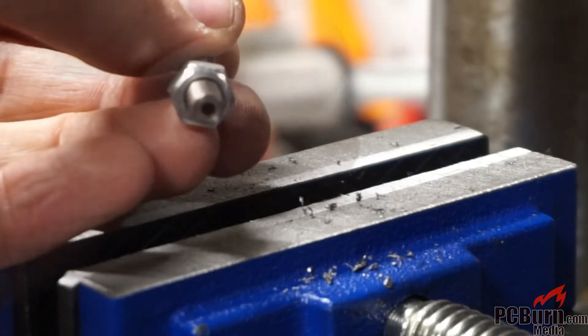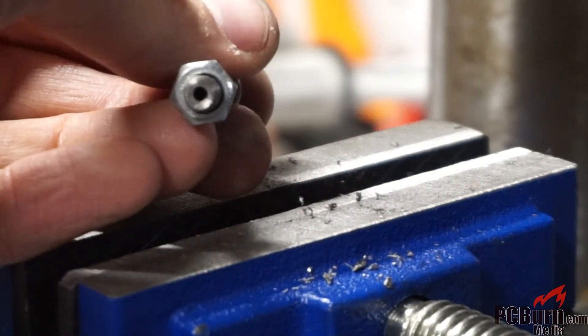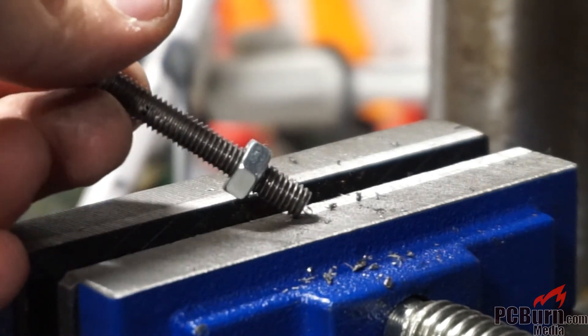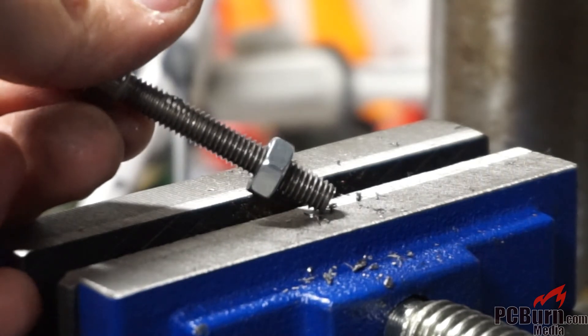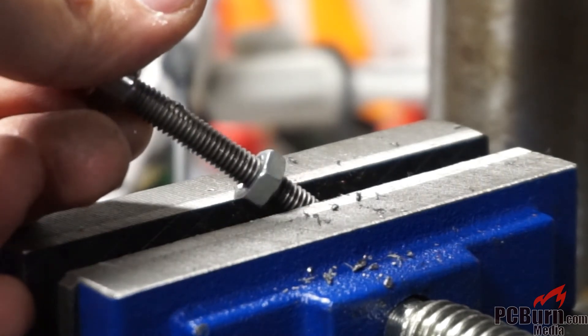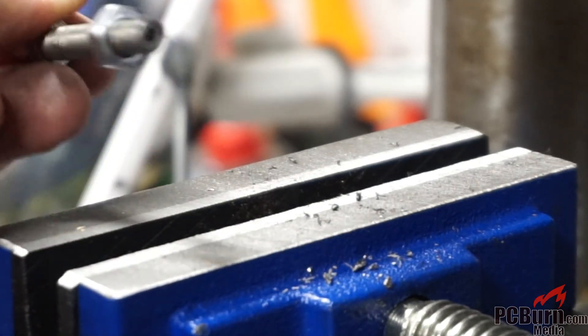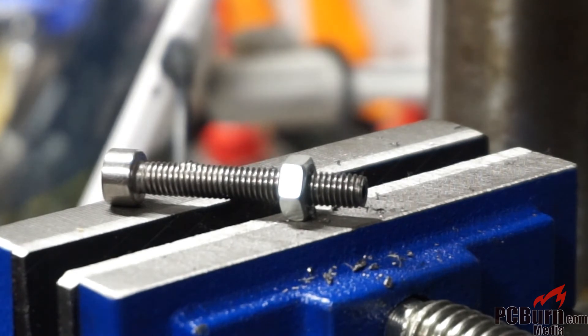It was a success drilling through the center of the bolt — that worked fine, it does look centered pretty well. Unfortunately the drill wasn't straight when it pressed through and it blew through the side of the bolt. Although the drill bits were fine and it actually worked great, so 90% I think the problem is the clapped out old drill press and the fact that it's not at all level or square. I have to take care of that first and then run the drill bits again.